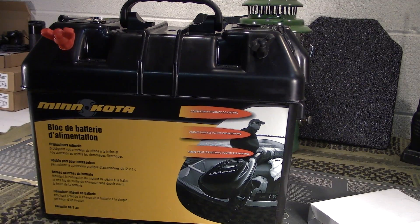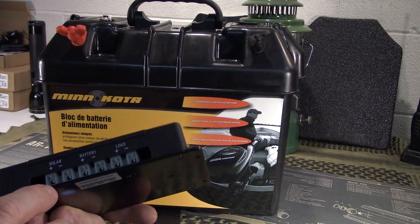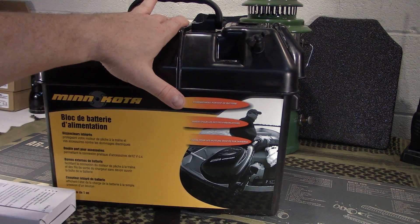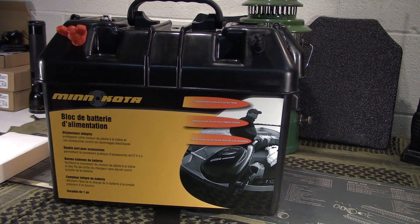The other thing I'm going to have to figure out is where I'm going to mount things — I don't want loose stuff around. This is my charge controller that came with my solar panel, and I'm going to have to figure out whether I mount it in the front or on the side. It has wires attached on the bottom and they'll have to feed back in to the battery and attach to the charge controller. I've also got to attach the inverter that I'm going to get — I want to get a 2000-watt inverter so I'll be able to power a lot of things, and if I wanted to add a battery later on, I could. I didn't want something like a little 400-watt inverter.